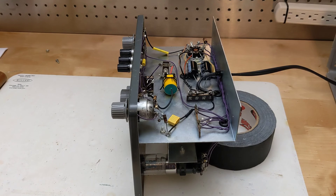This is still not particularly safe, and if it was to be used on a regular basis, I would use a three-wire grounded cord as well as add a fuse or circuit breaker. The line bypass cap is also a little higher in value than is now recommended and should really be a value like 0.01 microfarad and not 0.05. Otherwise, the current through it is enough for the potential for a shock. Some of the caps I replaced were bad and or leaky.